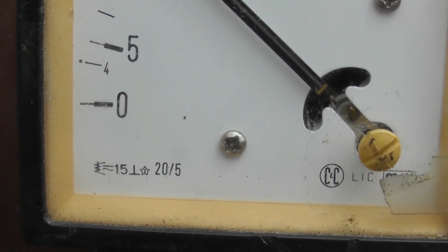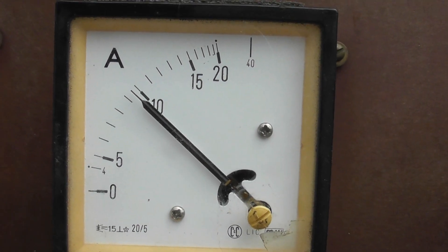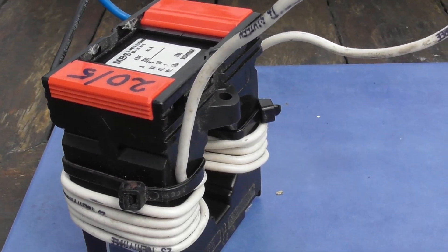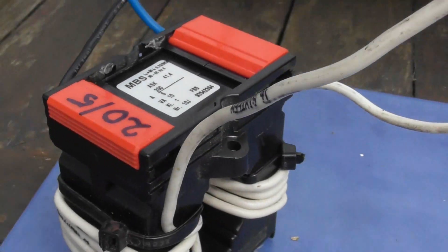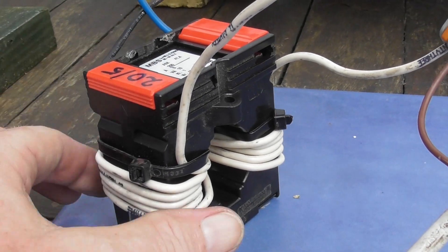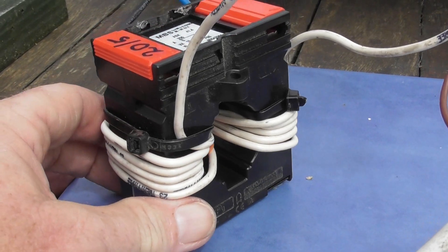I had the meter initially direct connected. The 22.5 pegged off straight off the scale — it's a CT meter. So luckily I had a current transformer that was actually 200 to 5. It's rewound up for the primary coil — 10 turns on there, so about 10 turns on the primary coil.